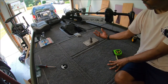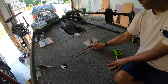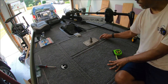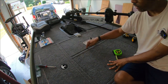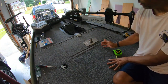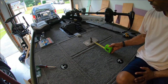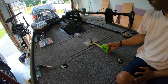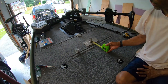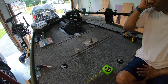I need to make sure the support underneath this lid doesn't hit the framing. The support will go right along this edge but come out two inches on all the remaining three edges — that gives me extra support underneath. I also made sure this is centered to the foot pedal tray. I'm going with a one and three-quarter inch hole saw bit to drill out the main hole for the pedestal post.